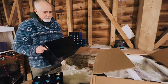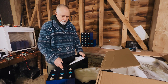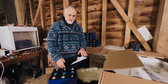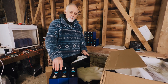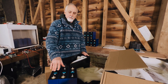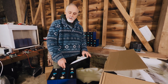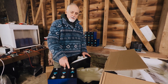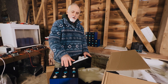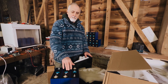We'll be using these to build a series of 304 amp hour batteries in a standard battery replacement size — and I say that with caution, because you can't always simply replace the battery. Sometimes your charging system is not appropriate for lithium iron phosphate. These are LiFePO4 and to get the most out of them they require a certain charging profile to maximize your return on investment. You can in theory use a lead acid charger, but they'll never easily reach full state of charge, and if you have an equalization phase that could damage the cells or the BMS. You should really use a proper charger.